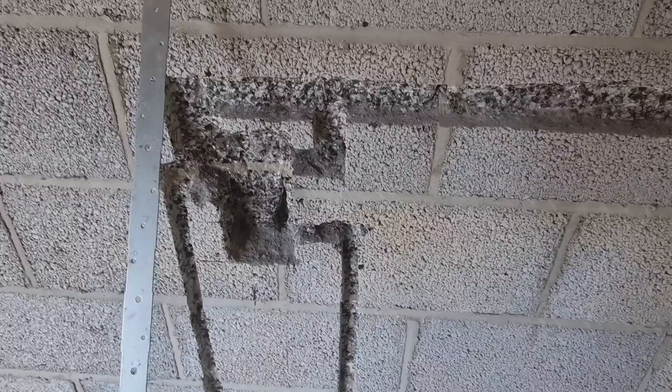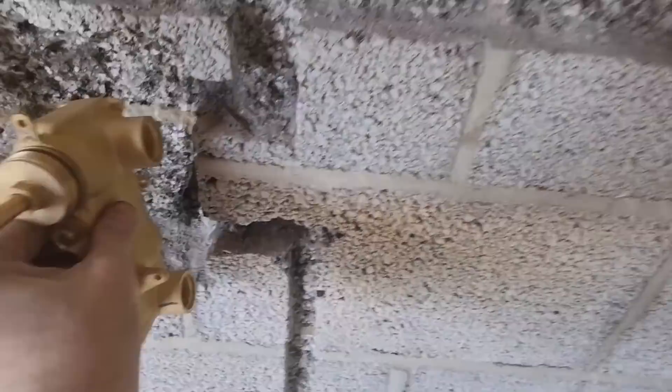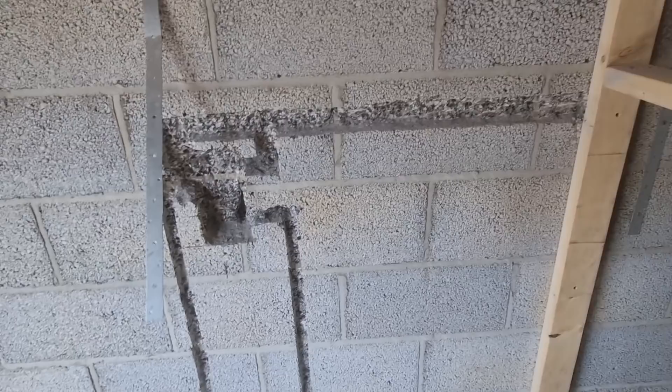After about half an hour chasing I've got something that looks like that. My valve will sit in there somewhere - obviously I've got to set the depths up. What I'll probably do is try and get some plywood in the back of there as well so I'll get better fixings. It's just because of chiselling it out - I've probably got to cut into that stud a little bit. I'll get it all out and just trim into here to bring my pipes through, and probably the same at the bottom as well just to get through. It's always a mucky job but it's got to be done.